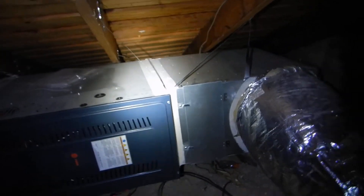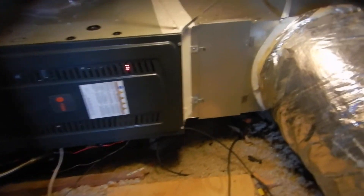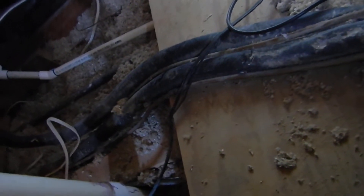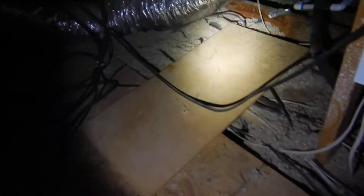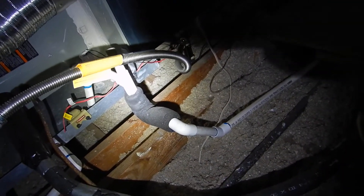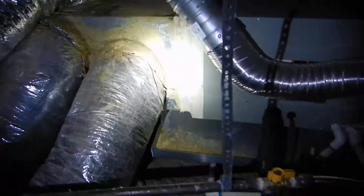This unit teeters and totters on top of that pipe, and I'm not going to crawl over there — I've learned to leave that pipe alone. The air filter is right there inside those buckets; it's a 16x25x1. When I opened it, it was pretty clean — looks like somebody was expecting me. We've got a sediment trap on the gas line, and the primary drain p-trap is shallow but insulated as it should be. We do not have service access, there's stuff in the pan, and there's a leaking air duct at the unit.